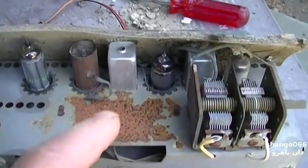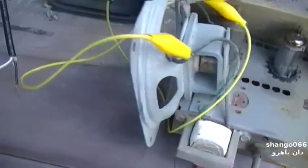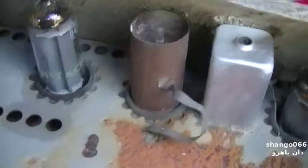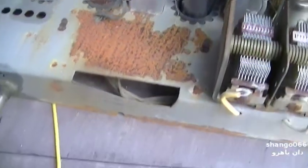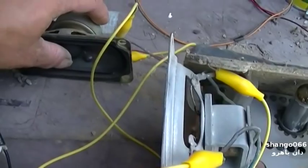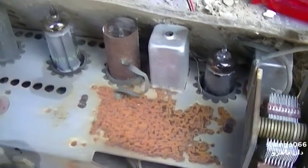All right, here we go. Got a speaker hooked up. New 12BA6 in there, a replacement. Got 400 ohms across the power line now. And here we go. Here's our suicide cord. Now, the whole idea here is hopefully something will blow up, right? Isn't that our goal with this stuff? And the tubes are getting hot. Tubes are definitely hot.